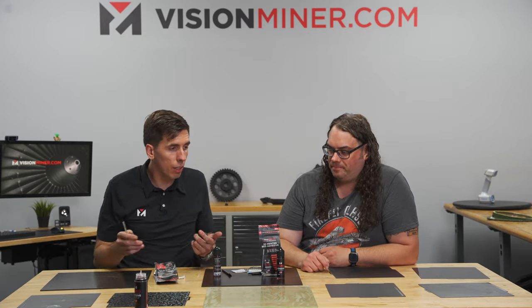If you get it on your hands, just wash your hands — totally safe. Don't drink it — it's glue, it's not a drink. The guys over at Titan Robotics like to call it the 'pink drank,' but that's because it keeps all their massive multi-meter wide prints down. Those are really huge, large-volume printers. A lot of them actually end up getting like one-liter bottles just so they can glue their whole plate and do massive polycarbonate prints or even massive Ultem prints.